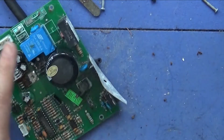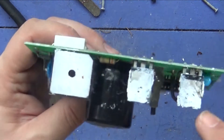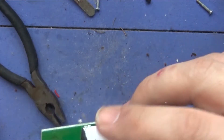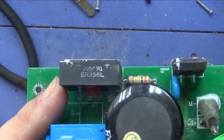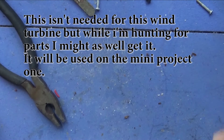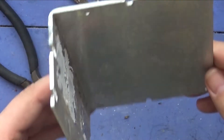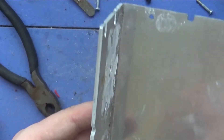We've got quite a bit of good stuff there. They've all got conductive paste on which can be cleaned off, but I want to check the serial number quickly. I've done some research and this is indeed a bridge rectifier — it's rated from 50 to 1000 volts and up to 35 amps, so that is ideal for what we need. I'm going to desolder that from the board and try to use it. I'm also going to use this metal as a platform to hold the motor on, but I have to clean it all up as well.